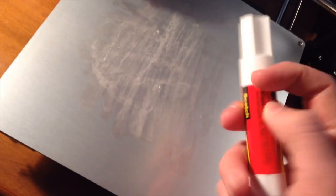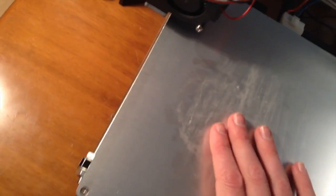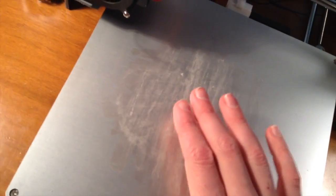Once your bed is heated — or you can do this when it's not heated, but you should do it when it's heated so that when it contracts, bad stuff doesn't happen — I have this stuff on my bed. This mess is better than blue tape, and I did not take a knife and scratch it up. This is just dried glue stick. Just take any old glue stick and do a very, very light coat. You don't need it really thick, because you want the same level as the bed, otherwise the extruder will start digging into it. All you're doing is getting rid of the smooth finish and making it a rough finish — something for the plastic to grab onto. You want it fully dry, because you're not actually creating an adhesive. What you need is the crevices — on a microscopic level it creates all these cavities, and that allows the molten plastic to seep in and hold on.